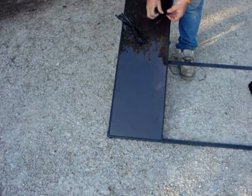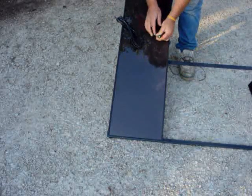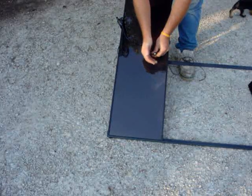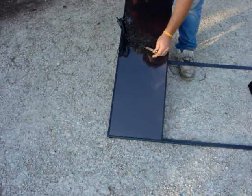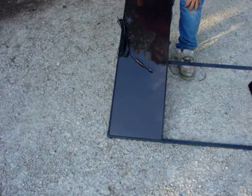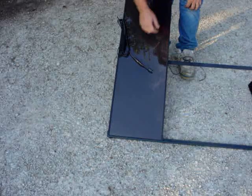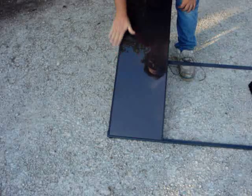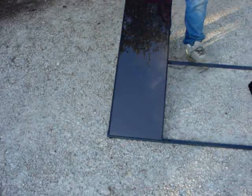Now you remember I had this little LED part here. We're not in full sunlight but you can tell that LED is lit. It's a 24 volt LED with the resistor network in it and it will not light up on 12 volts. Even in the shade it lights up real nice. So this solar panel is good.